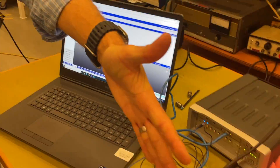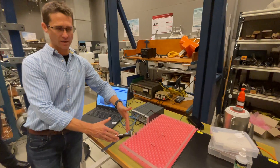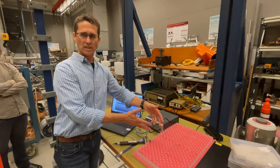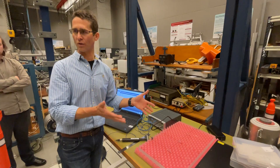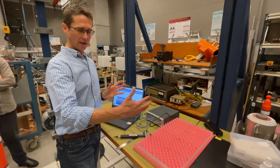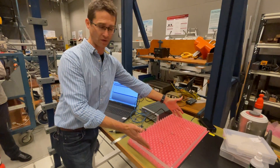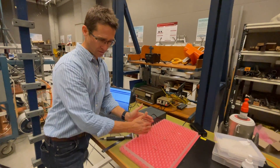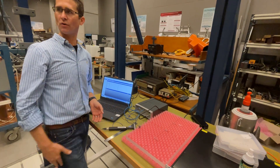It's up to you to take your plexiglass plate, discretize your continuous geometry down into a number of degrees of freedom. As part of the project, you might say let's look at six degrees of freedom — do six measurements initially. I know that I can probably see the first two or three modes of vibration with six degrees of freedom. If I want to look at five, six, or seven mode shapes, I need more degrees of freedom — so I might need 15. In the example we looked at in the lab I had 15. If I start to divide those in half again, we almost exponentially get a lot of degrees of freedom to test.